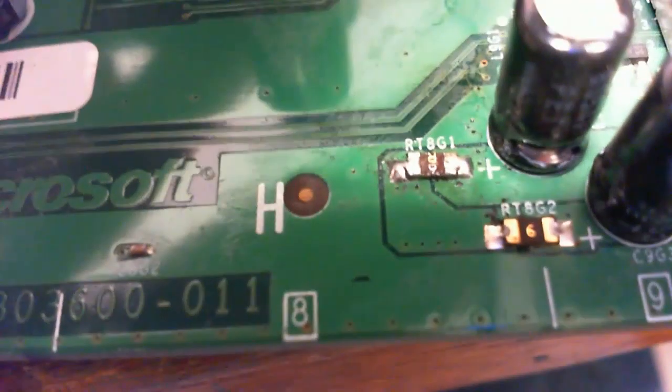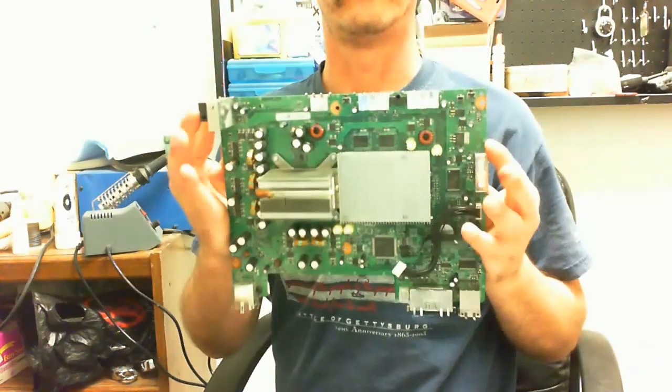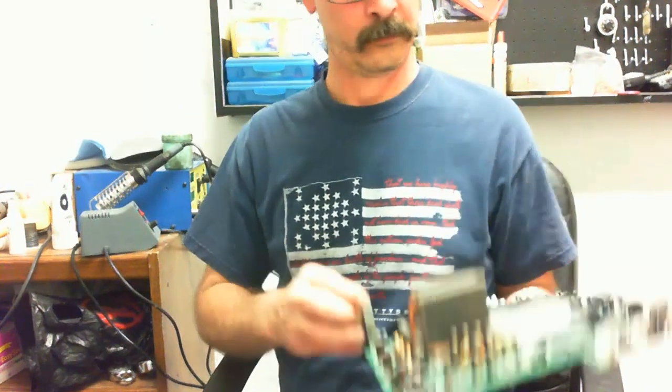Now see, that component was nice and straight. There's a little bit of it kind of misshapen on the left side of the screen there of that component, but that's nothing. The underside is making total contact and we're all done. So this board was in fact a successful repair. Okay, nice work there. Everything worked out fine. The box is operational at 100%. There was no need for a reflow. I do believe everything should be fine on it.